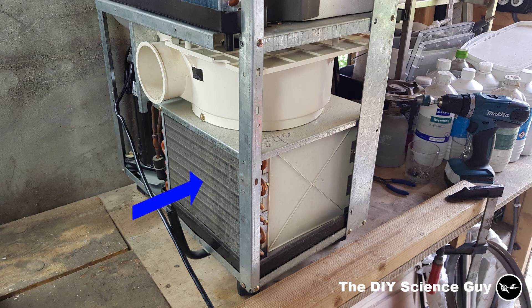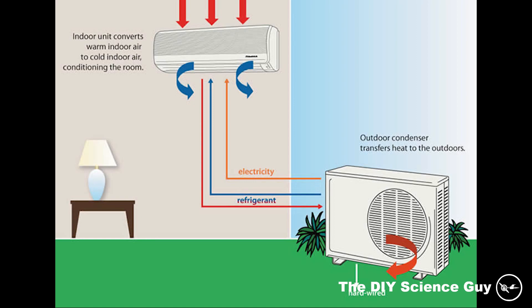The fact that it used cold air from the room is not really the problem because it makes the whole cooling cycle more efficient — you will get that low heat air back at the other end anyway. But the problem is that by blowing air to the outside of your house you create a low pressure which sucks in warm air from outside, heating up the room. Also the hose through which the air is blown outside becomes very hot, again heating the room. I believe this unit had a capacity of 2600 watts but probably half of that energy was sucked back in and radiated off the hose, making it much less efficient than a split system.